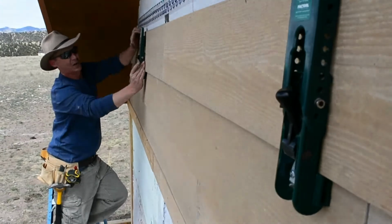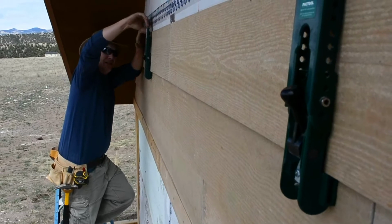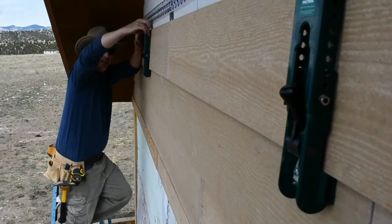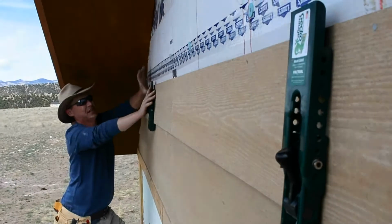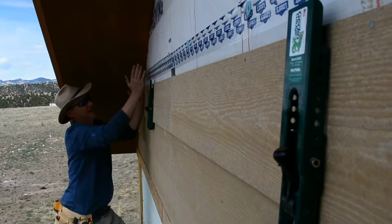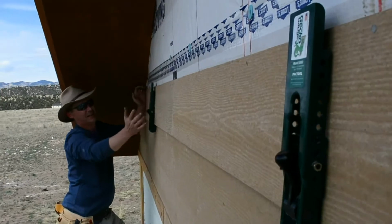One other thing I wanted to tell you, that it's really just the nature of this. All your clamping is going on down here. So when you hang this next sheet up here, it sits down in this groove, right? Well, the problem is that if you're not paying attention, it can actually push out like that, and the panel can slip in between there. So you want to pay attention to that and make sure that you push that in after you set your panel on your next row. You drop it down into place, slide it up in your corner, mark it, however you're going to do it, but then just make sure you're not getting in between this and this, and then you should be good.